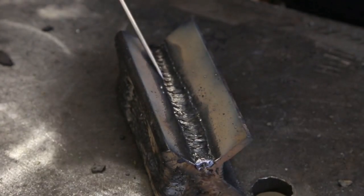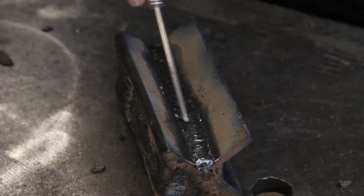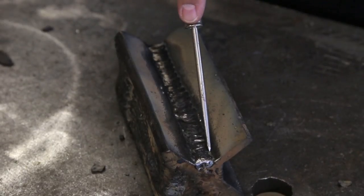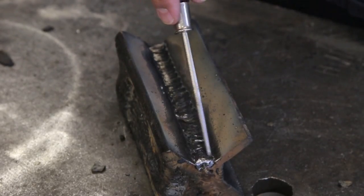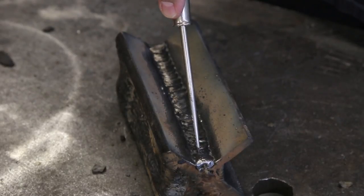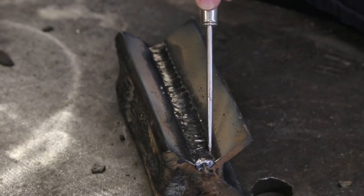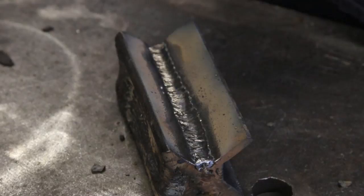This weld went in pretty well. Over here is the best part because I had nice clean weld underneath to work with. Here we got a little bunch-up area, but for the most part we were able to break down that ugly weld and fuse into the side — with one exception. Right at the very beginning there's a little slag inclusion. It could have been trapped there from before, or because as I was going side to side over that glob of poorly applied weld some slag got trapped right in the corner. In the field, the right move is to grind this out, and that's exactly what I'm going to do.